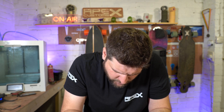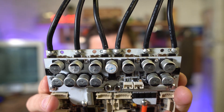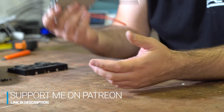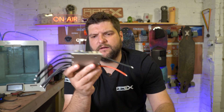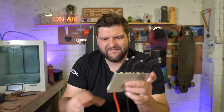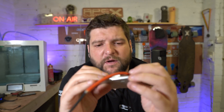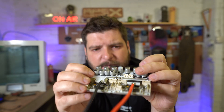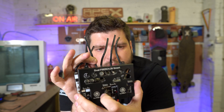No solder balls in here — the soldering all looks good, apart from a couple on the phase wires which look a bit cold. That's about all there is inside really. One thing I'm not keen on is these bus bars — that's the positive bus bar and that's the negative bus bar, bringing power in down to the bottom PCB. I mean this is anodized, but still, I hope they sit far enough off the PCB that it's not going to be a problem. I would like to see some foam or something on top of those bus bars, but I guess they've done their homework and they aren't going to touch.